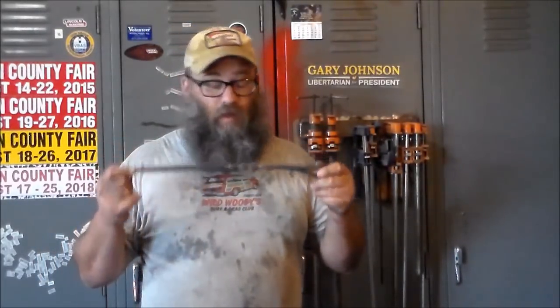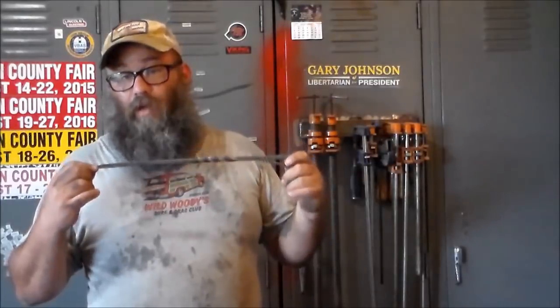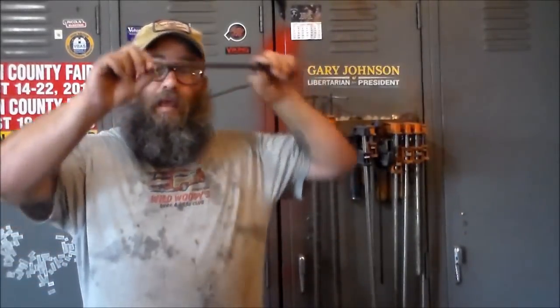But essentially, we start off with 18 inches of 3/8 square stock, which you don't have to use that particular material, but that's what I start off with on this one. You bring it down to a point and then taper it, round it, make a hook, and put a handle on it, and I put a decorative twist in. And you can use it on the grill to pick up steaks, pork chops, chicken, not hamburgers, but other grillable things, and flip them.